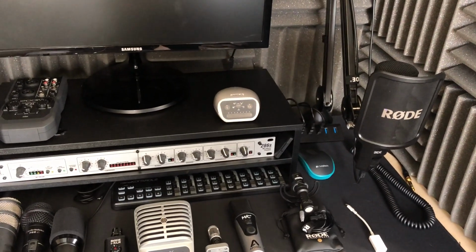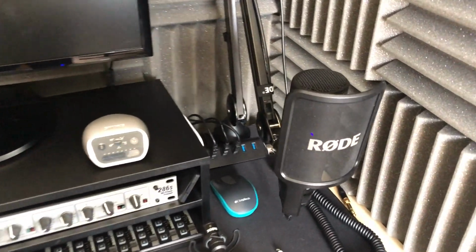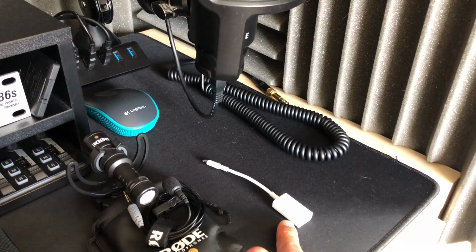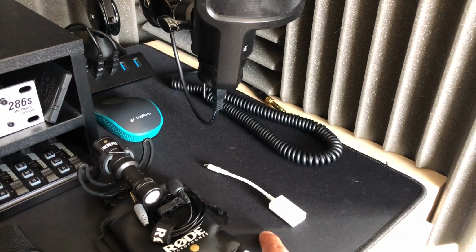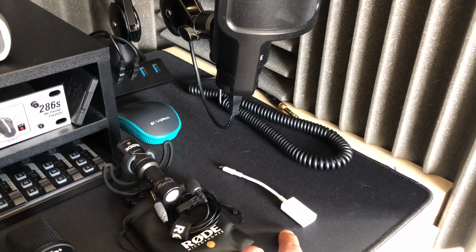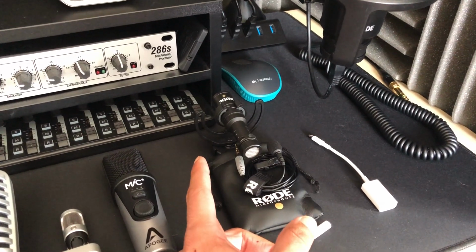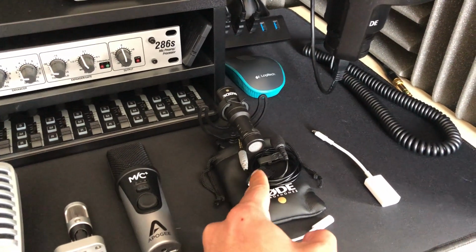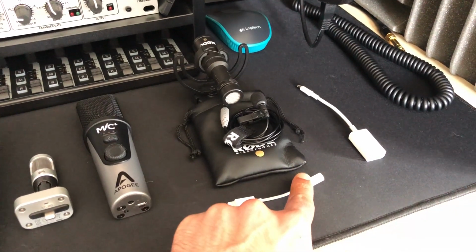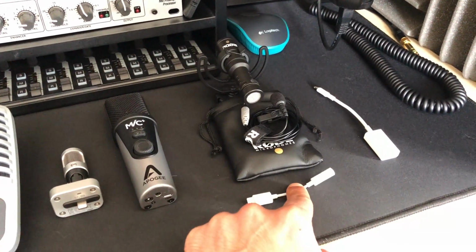The other way would be to connect a USB microphone to your iOS device, and here I have this Rode NT USB, but for this one you will also need this Lightning to USB adapter, and your iOS device will recognize it straightforward as it is a class compliant device. If you have any microphone for video like this Rode Video Micro or this SmartLav Plus, you can use this Lightning to mini jack adapter included with your iPhone 8 or iPhone 10 or iPhone 7 as well.